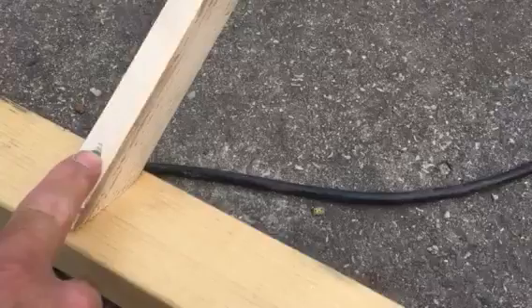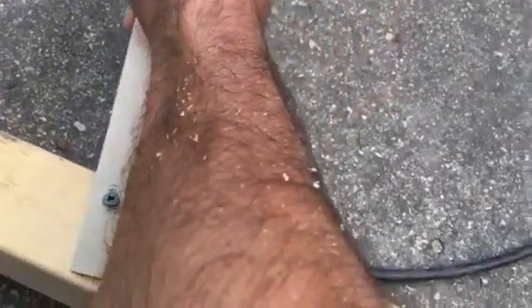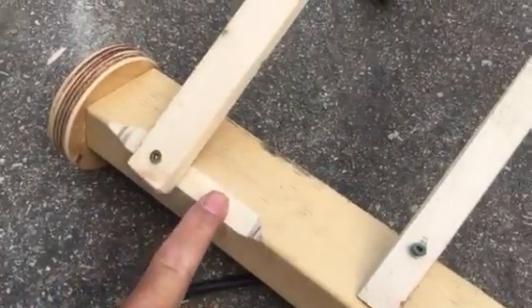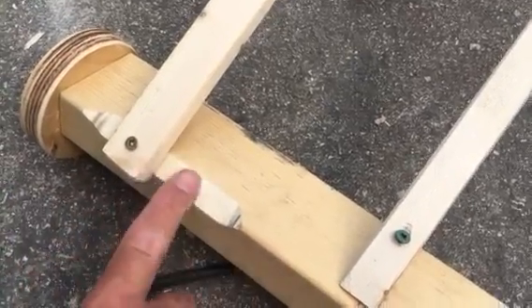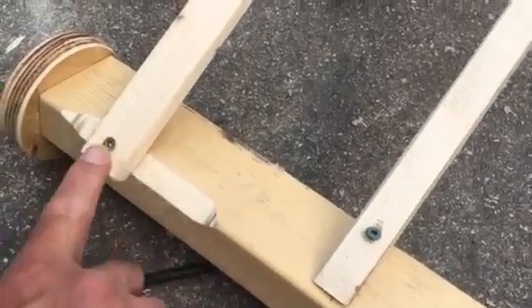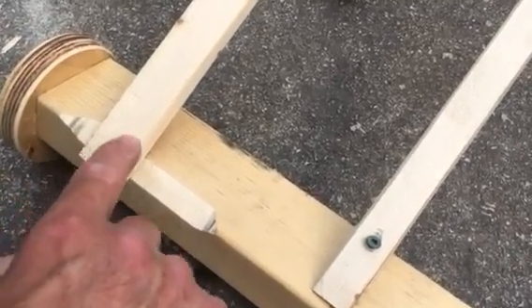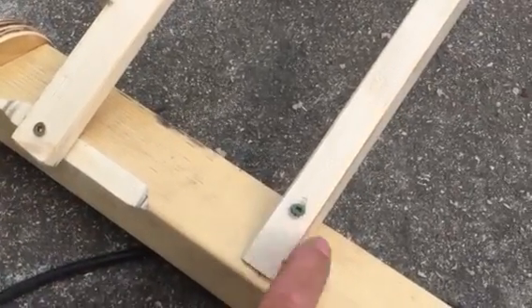This here is a regular screw but I pre-drilled this so that this pivots. This is the steering arm. Because it goes on an angle and this is quite light, rather than bevel this, I beveled the actual axle. I pre-drilled that hole so that the screw isn't tight on this piece of wood — it's tight on here. This is loose on here and tight on here.